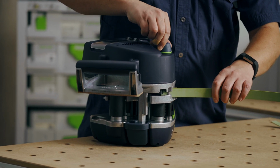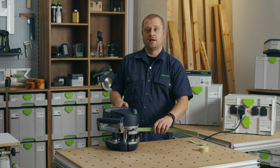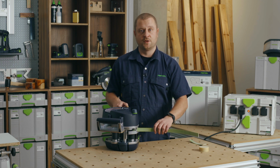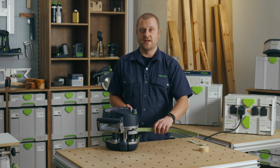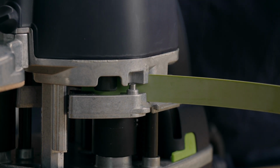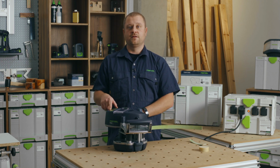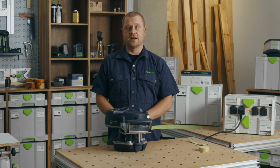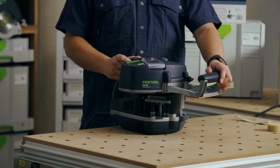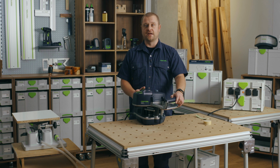Press the prepare and go button with your thumb and the symbol to insert the edge will appear on the display. Guide the edging into the feed slot until it is drawn in by the CONTURO. When the tick appears on the screen, the edging has reached its starting position and is ready for gluing. The display will change between the tick and the full display for a final check that the fuel gauge displays enough distance for the edge that you are about to apply.